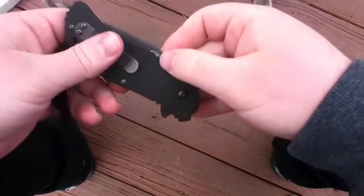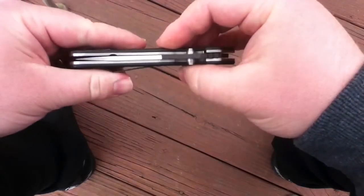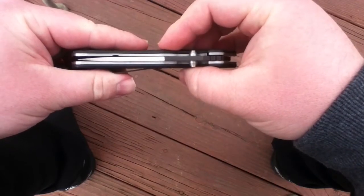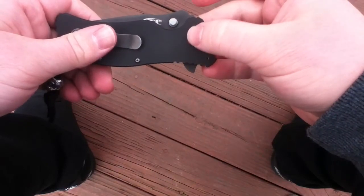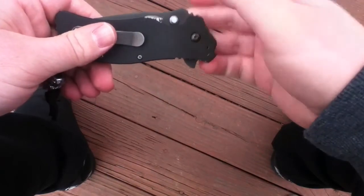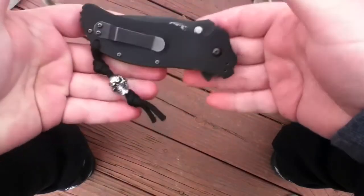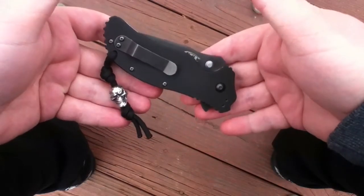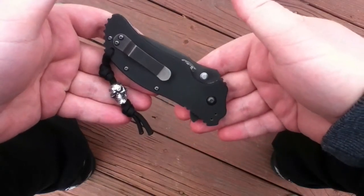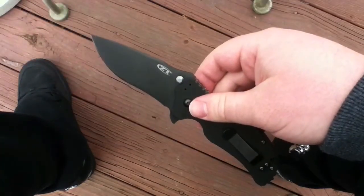One thing that I have noticed though, taking the bar out, is you can kind of hear it. No matter what I do, the blade is just slightly off center, and I can't get it to center quite right. I think I need an oversized washer because the washer on this side is very small. So I'm going to probably pick up a washer, take it apart again, and replace that. But aside from that, I'm pretty happy with how it turned out. So there's my 0350 into an 0360-esque mod.